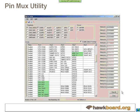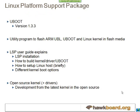The pin muxing is quite complex on this device — there are so many pins and up to five levels of muxing. We've provided a pin mux utility that can be found on the product page on the TI website. This GUI allows you to pick which peripherals you need to use for a custom board, figure out how to set the values and registers for the pin mux, and once you're done, save it as a C header file to use directly in your code. It generates all the correct values for you.